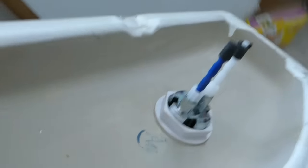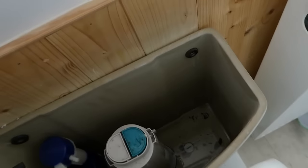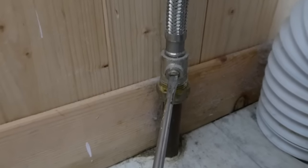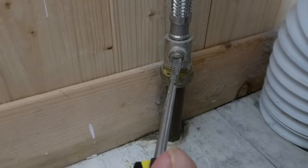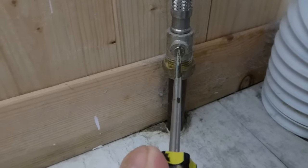We'll stick the lid back on. Mine's one of these ones with detachable buttons stuck on the lid; others are not — some are screwed down, so if you've got a screwed down one it is slightly different. That's our lid on. Now we'll just turn our water back on at the stop valve down there. You can do this with the water on if you like — all it means is it will be running into the pan the whole time you do it.